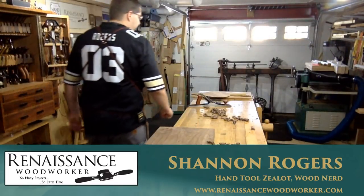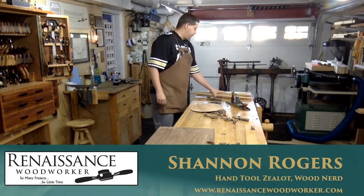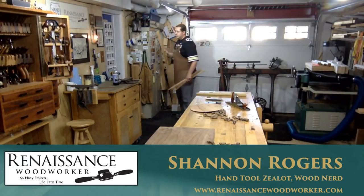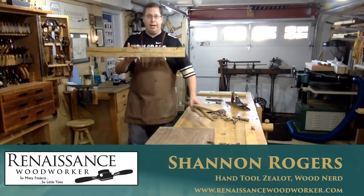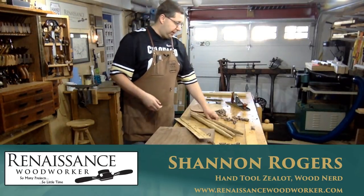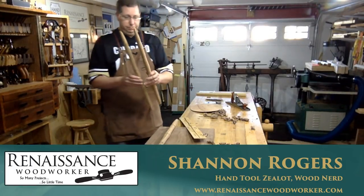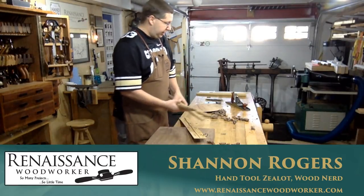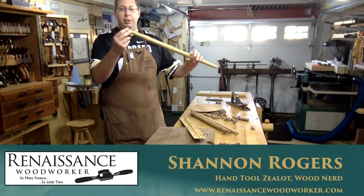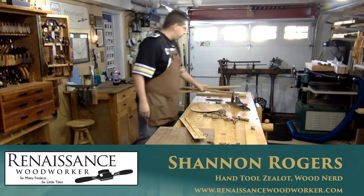All right. So last time I focused on the legs and the design pattern for those legs. So this little piece of plywood has all my layout for both the two rear legs and the front leg. And here's the front leg, and here are the two rear legs. So I got all that nicely turned, and I used my tapered tenon cutter to cut the tapered tenons on the end with half inch at the smallest diameter. So the legs are prepped, ready to go.